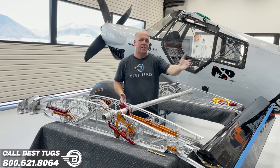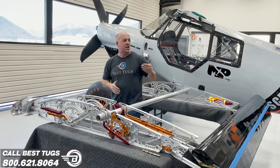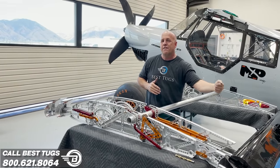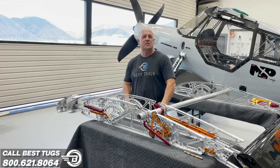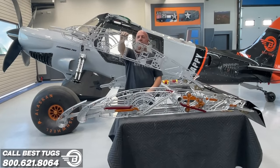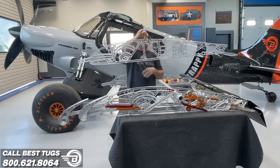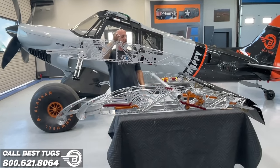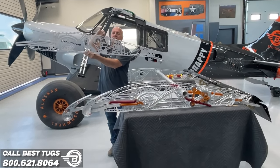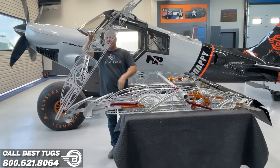So you do a bigger elevator, that creates more and more power, more and more blast, and you're just negating a portion of the benefit of your flap and your drooping aileron, so they just didn't seem to work well. If my wing and aircraft center of lift was in this position, it's actually more up here, but let's say this was the balance position, and I deploy flap, what ends up happening is it pitches the wing forward, and it ends up like this.